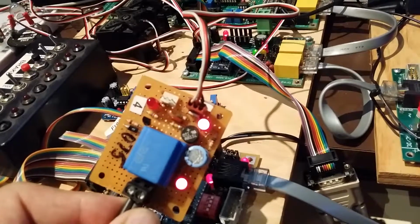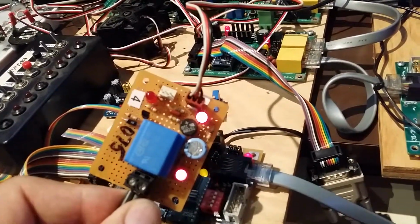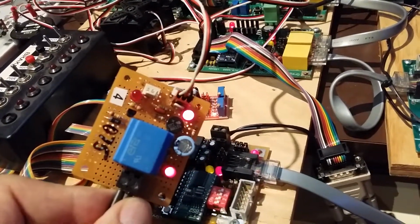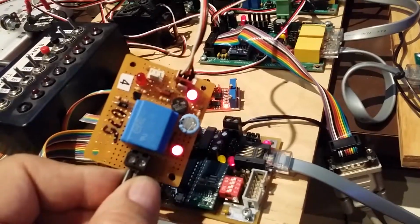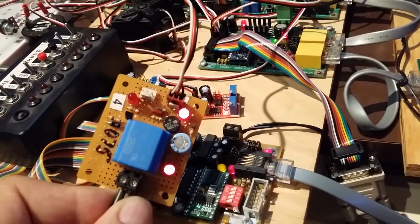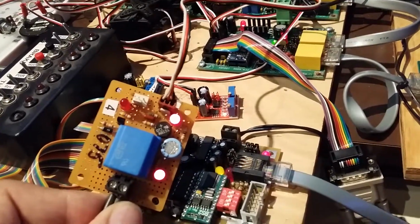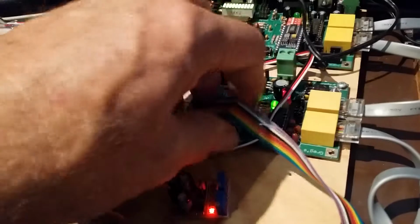So then I have a voltage divider on the output of this. This is a 120 to 12 volt transformer, very small one, which is just fine for me. And when I get full range out of my Variac, it's about 140 volts. I get 18 volts DC after it's peaked through the bridge and the cap at maximum, but I can only read on my system here.